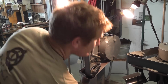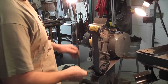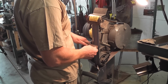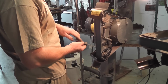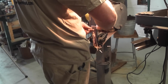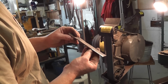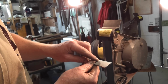And then when it comes to the actual bevel grinding, normally freehand setup. Grinding one side, placing it on the belt, just supporting it on my fingers. And grind on one side. And then we'll do the other side. So without too much effort, we took off those corners. And you can see this nice plunge line that we get there from the corner of the belt.